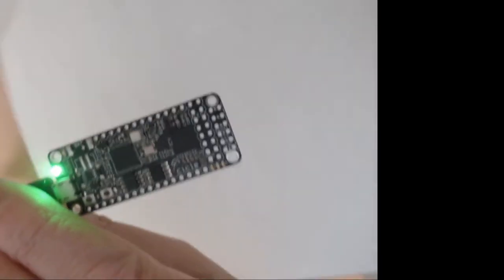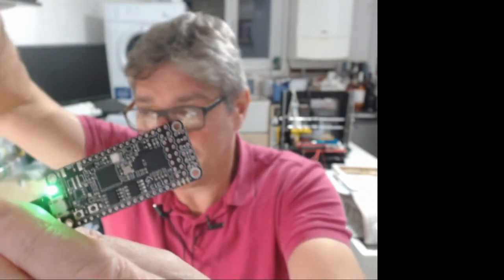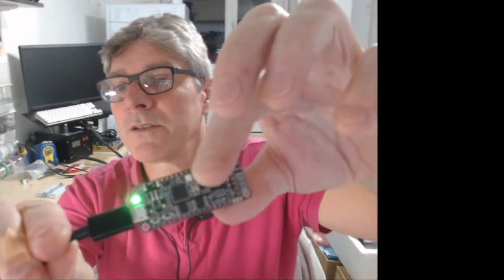And if you can see that white thing towards the top there, that is the antenna. So, one of the things that I tried to do this week is actually see if the Wi-Fi was operating. And the answer is yes, it is operating, but it's not operating very well. I was wondering whether it was those antennas because I hadn't used those before. My Wi-Fi experience, as far as designing the electronics, is very low. I don't do radio generally. But I don't think the antenna's the problem.